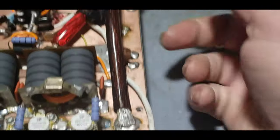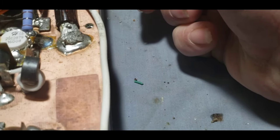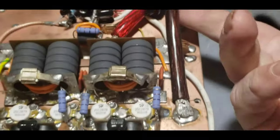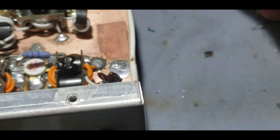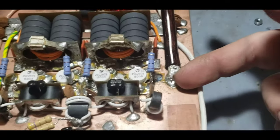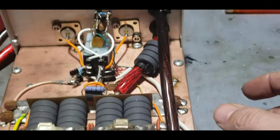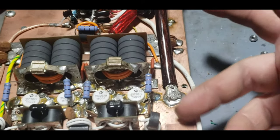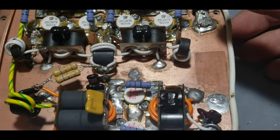I would have put this ground wire right here — probably back here. Looks like that may have been where something was, a little small eight-gauge. This is some big thick four-gauge — definitely overkill, but there's nothing wrong with overkill. I'm not downing anybody for putting their ground wire in the middle of the box. There's nothing wrong with that. I just like putting mine back here in the back — short run, ground plant at that point.